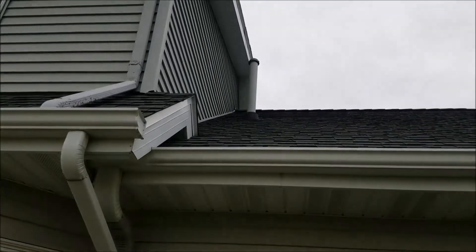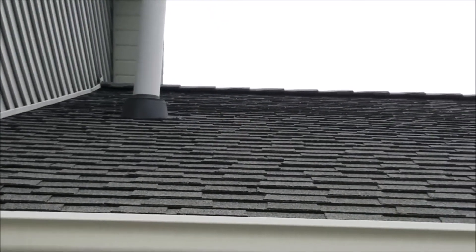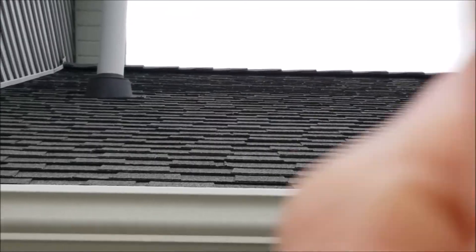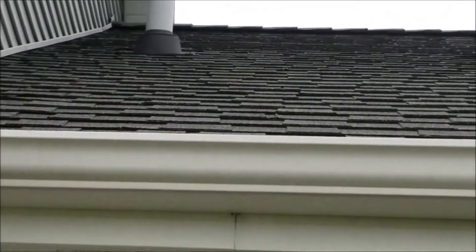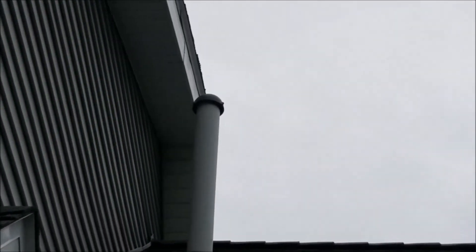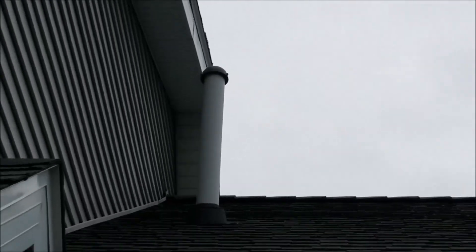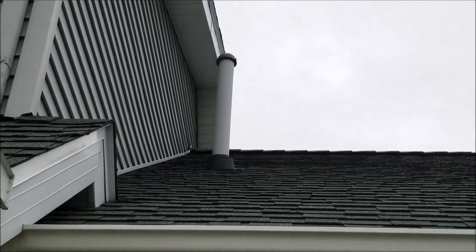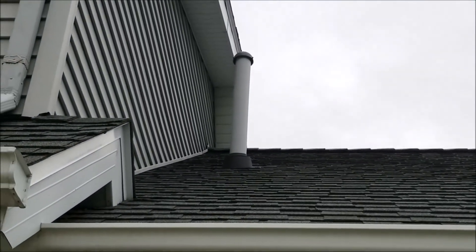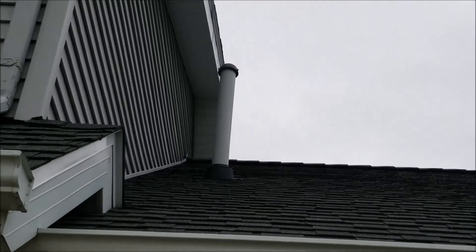This is the official end of the line. Down at the bottom you can see a roof vent pipe, and way up on top there's a cap — all just stuff from the local hardware store. Usually in the winter you'll see that ice over. It has to be a certain distance away from any windows, and it's going to be above the roof line. That's the system.